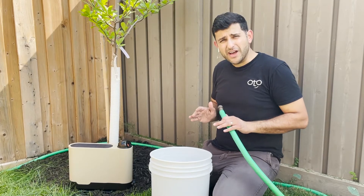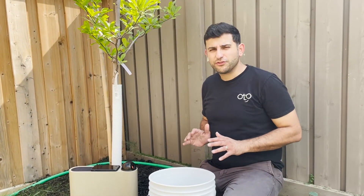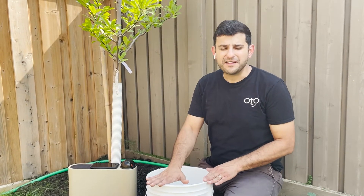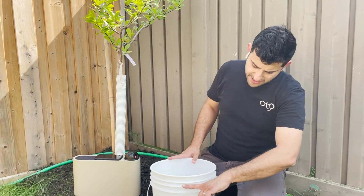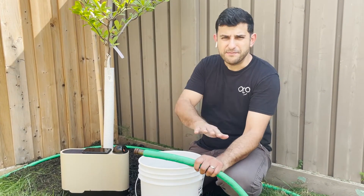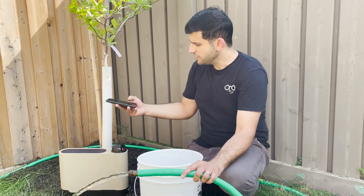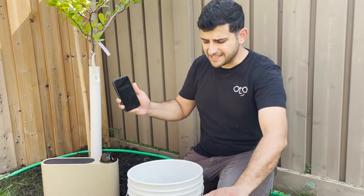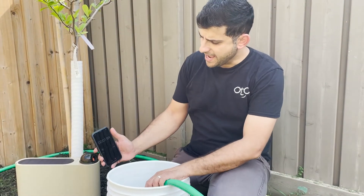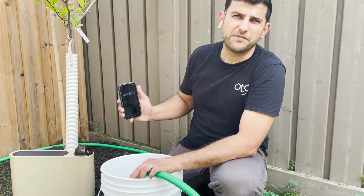A really quick way to know that is to fill up a bucket and time it. Measuring the flow rate is really simple — if we need 5.6 gallons per minute, we should be able to fill this 5-gallon bucket, right to the second line, in about 53 seconds. Start the water and make sure all the air is out of the hose and the line. Use a stopwatch — I'm going to use my phone — and at the same time as putting the water in the bucket, start the timer and watch to make sure the five gallons fills in about 53 seconds.